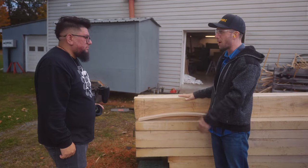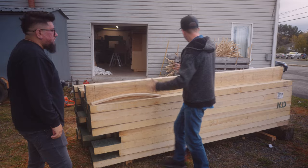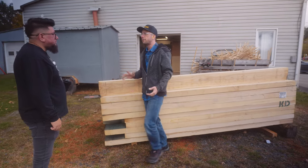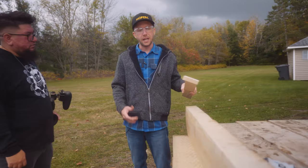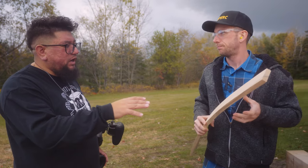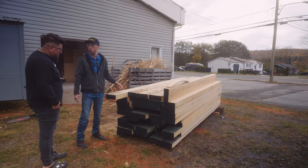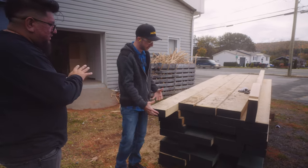So Eric, everything starts from the raw material. This is a North American white ash, but same thing when we receive whatever type of wood — it's a big bundle, nine or ten feet long. The quality control starts right here outside. We check if there's big cracks. This is select wood, kiln dry to about 4% humidity, so it's really dry and ready to work. If you make a drum with wood that is not dry, it's going to start drying and it's going to start moving, which makes it inconsistent.